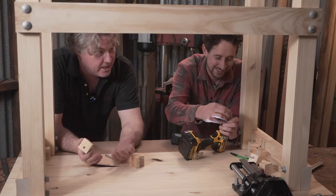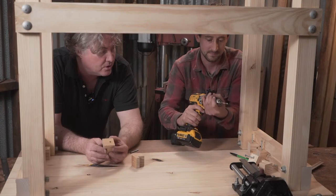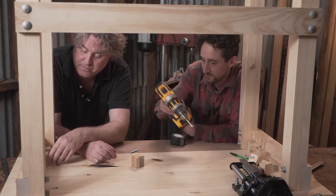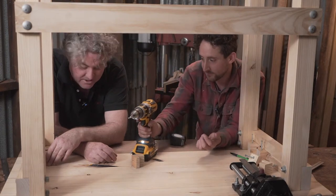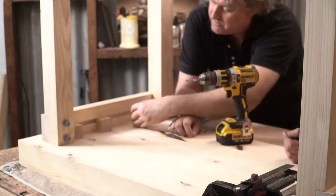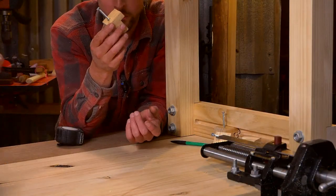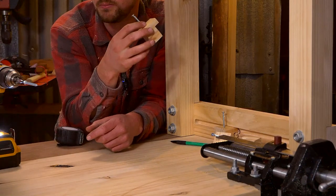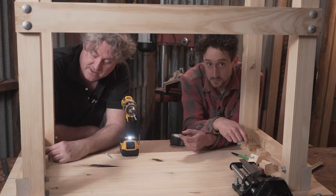Welcome back to the even tinier workshop. We're here with our hold-down blocks that we made earlier. We just had a minor technical concern because it's a little tight between the inside edge of the rail and the screw position. We're going to set them out - put one in each corner and then one in between - just make sure the ones in the corner have three or four mil away from the legs. Screwing down one over here - this looks as easy as it is to do. Rather than any elaborate hardware or bolts or joints, just make yourself some little blocks and you can use this to hold down the top on basically anything.